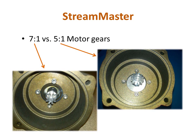These two pictures show the reason for the different motor subassembly part numbers. Not that the motor itself is different, but the gearing attached to it has changed. The newer gearing uses an 8 tooth gear versus the original 12 tooth gear. The smaller new gearing is the reason the spacer is required.